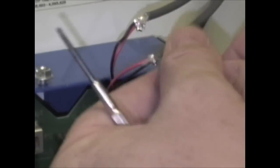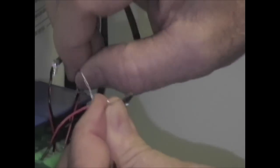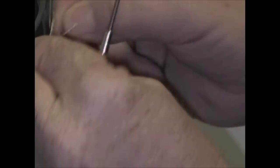Next, connect the collector, tank, and optional auxiliary shield wires to the shield pin on the far right of the collector sensor block. You will need to attach a short wire to the shield block to wire-cap the shields to. Twist the wire around this short wire and insert into the wire cap.